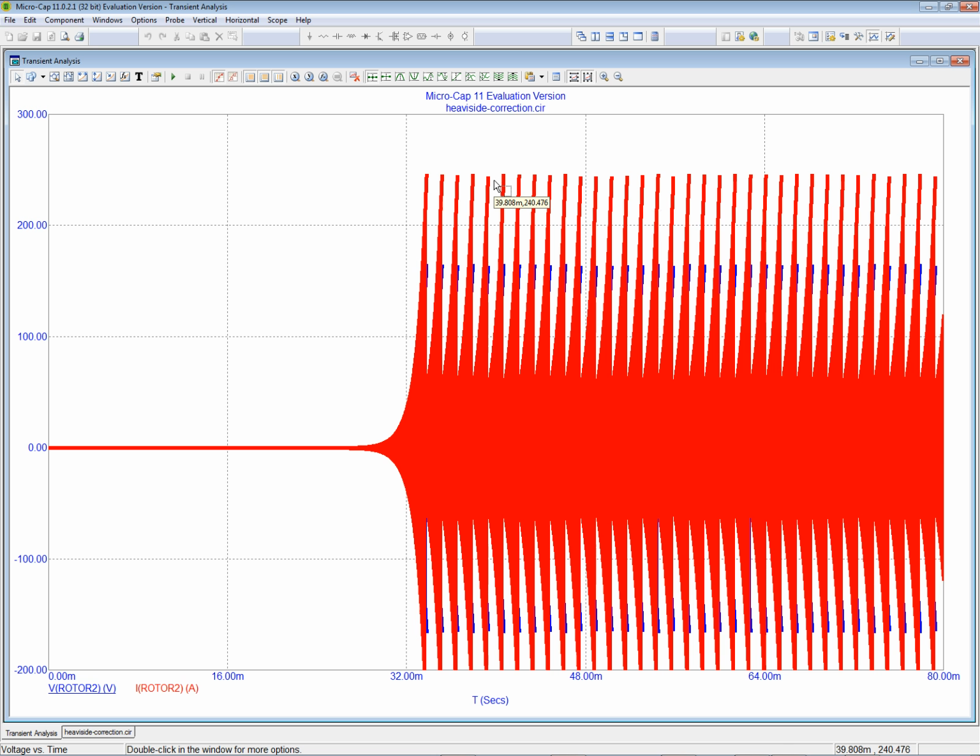And I think that's what they do in an AC motor. They call it field excitation. They vary the field excitation of the coils, which means, you know, in a DC motor, you vary the current and you keep the voltage constant. But in an AC motor, it's a little different. So I guess maybe that's what I've managed to do here. I've managed to reduce the excitation level overall of the coil because the amps still dominate, but they don't dominate as much, though. They have come down. That's right, they have come down.